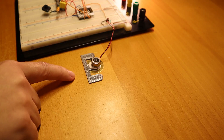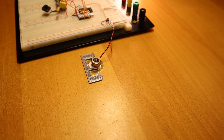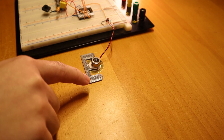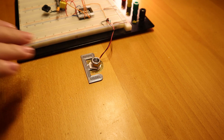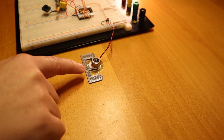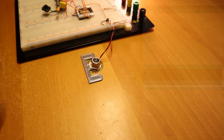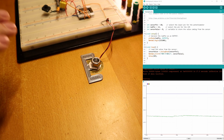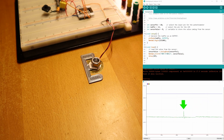Here's a prototype of the circuit with the piezoelectric disc connected to the ESP-12. I've 3D printed a jig that sticks onto the surface and firmly presses on the sensor. I've also added a weight on the sensor so there'll be more movement when I knock and give us a better signal. Here's a simple Arduino sketch that samples this analog input and plots on a serial plotter. When I knock, I can clearly see a spike on the graph.